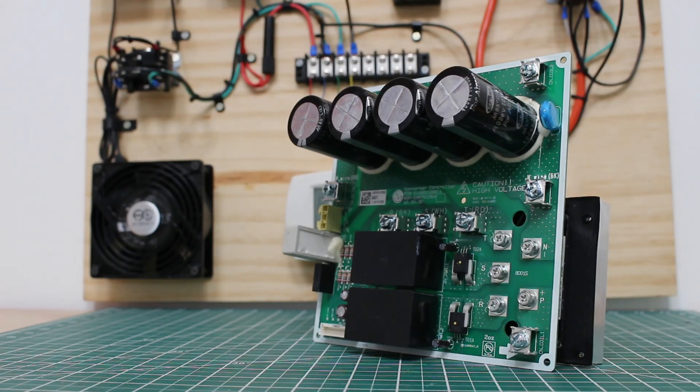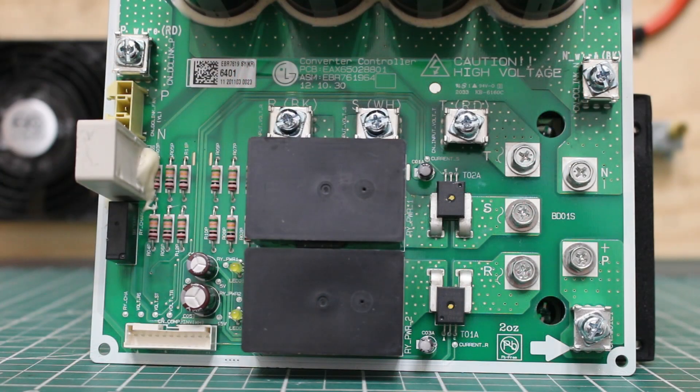Let's begin with our testing. First things first is always safety. What you're going to want to do in a real-life application is turn the power off, and I'd give it five minutes — specifically in this kind of system so everything can de-energize. Keep in mind this is not like your regular AC HVAC system. Next, what we would do is isolate the wiring for this bridge diode so we're not going to get any feedback. You definitely don't want any feedback; you want to get an accurate reading. So I would take off the wires. Once we are safe with the power off and the board is isolated so we do not have any false readings, we can begin testing.